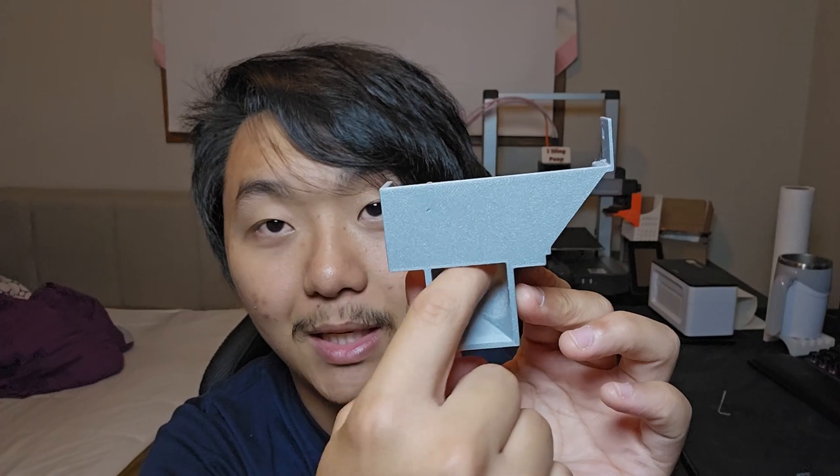But when I went back and tested, there was a huge problem. I did not realize that the Cobra 3 shoots the filament while it's still super hot. So I tested with cold filament — I put it on the slingshoter, pulled the trigger, it went here, hit the wall, bounced down into the bin, and came out into the cardboard back there. There were many problems. The main problem was the filament was still super hot, so it shoots, hits the wall, bounces down, and gets stuck in here. After a couple of shots it just piles up and filament goes everywhere — it gets clogged and just doesn't work. The second problem was that the box was way too tall. When the print head goes down for homing, it hits the box and all the filament poop splatters all over the place — it was chaotic.